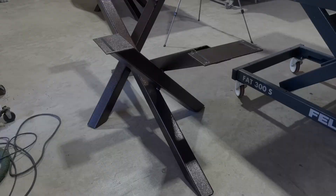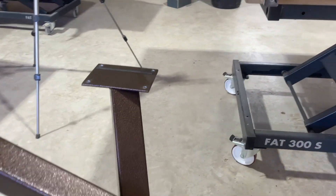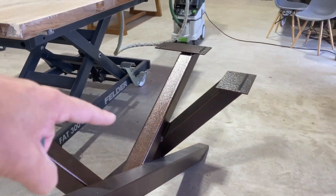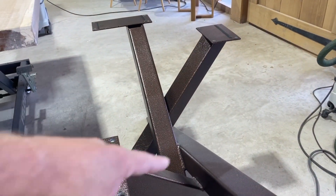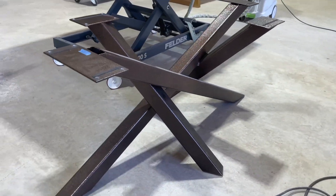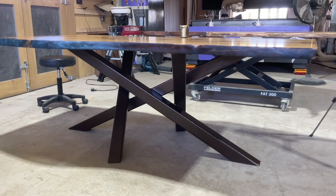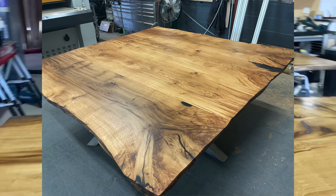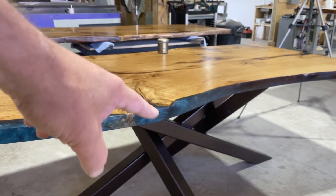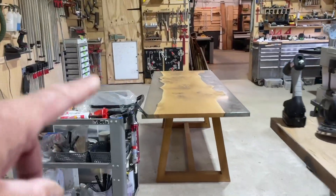This is the really popular x-frame spider leg design. I did design this myself - the key to ours is using these big compound mitres on the bottom of the feet and having no hub, no square hub. When it's on the tables it looks absolutely stunning, it seems to make the table float. I'll put a shot of a table I did last year - a huge 250-kilogram, two-by-two-meter table - and with these bases, slightly bigger, 80 or 90mm sections, it just makes the table look effortless.